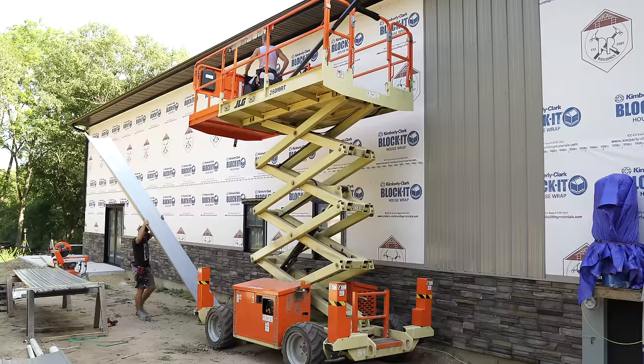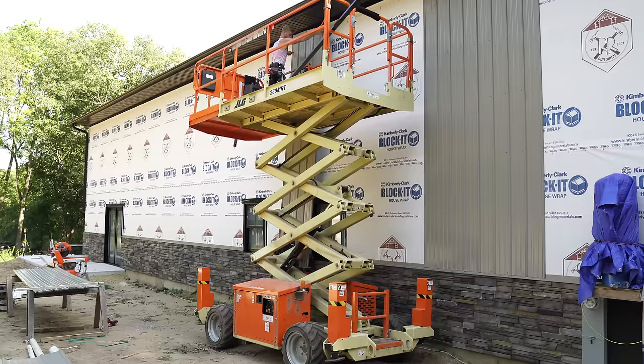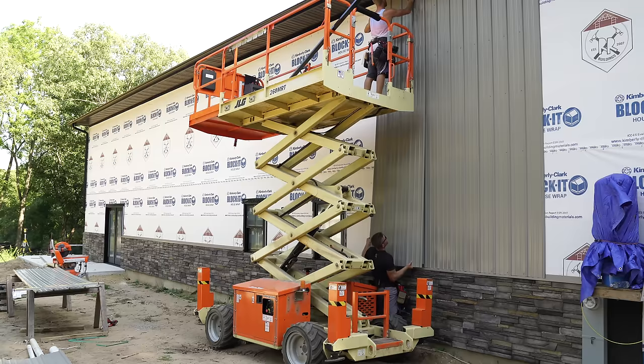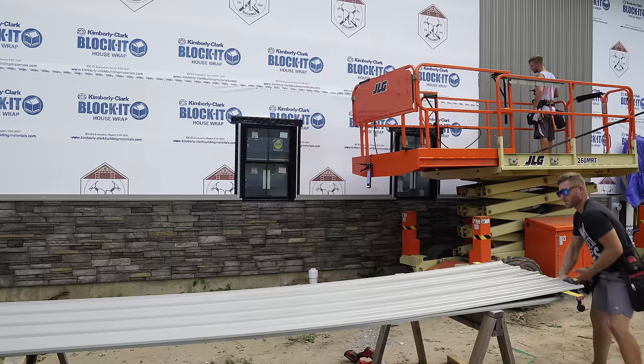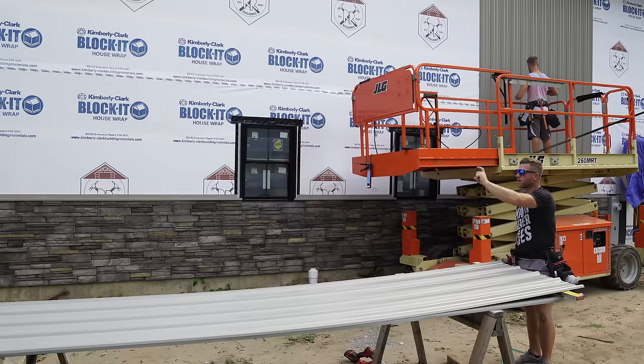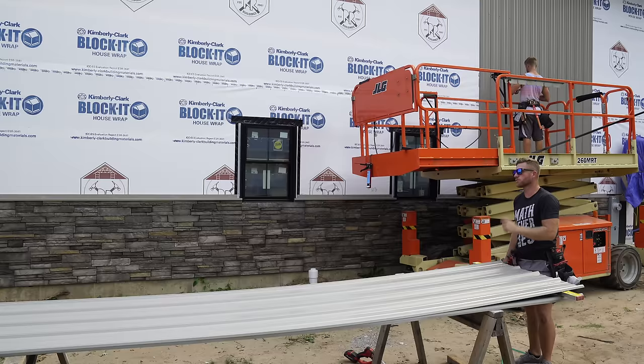Let's watch these windows. Got what it feels like to get scratched by the steel. Unfortunately, I don't know why, but we're like a quarter inch long on our steel from where the stone is, and that could just be over the course of those five runs of stone, we just grew enough. I would have used the 8-inch dimension of the stone, but sometimes it does grow a little bit. So I gotta cut down the tops of all these pieces.